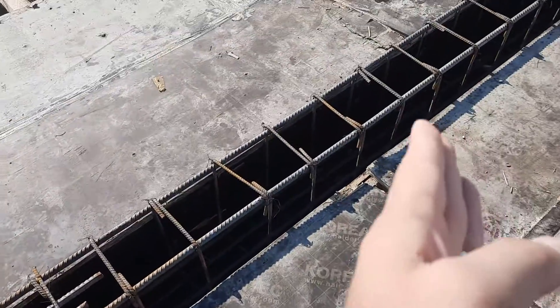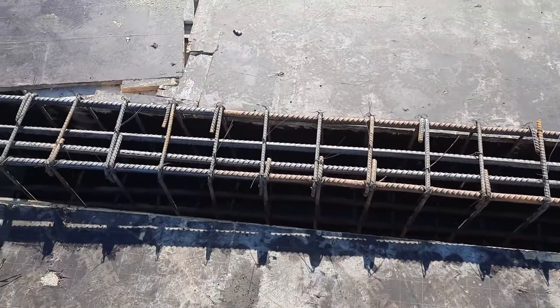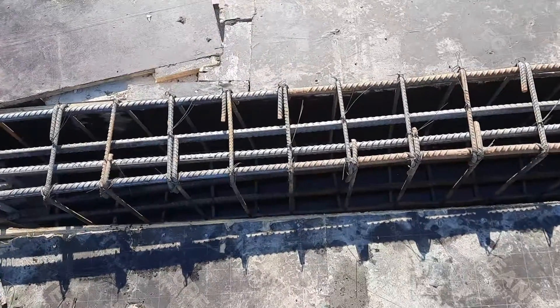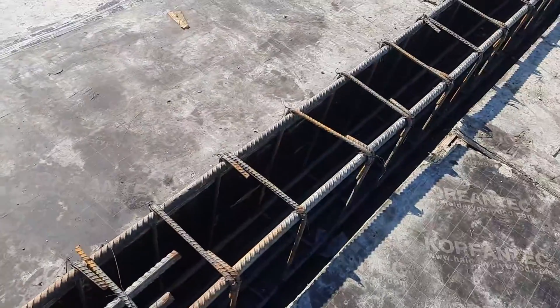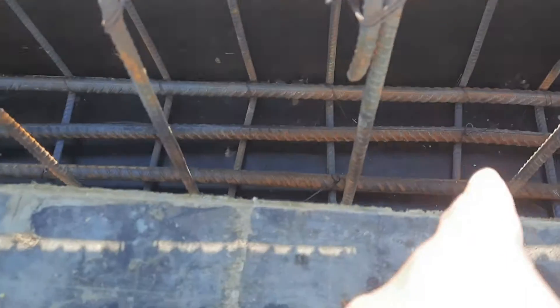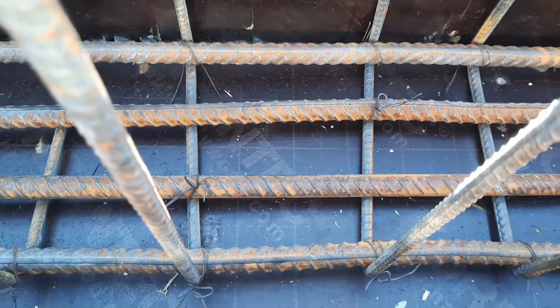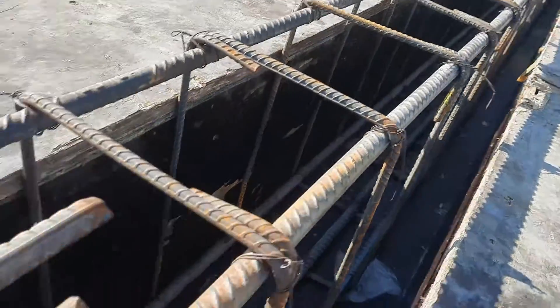You can see this is Section A-A where we have negative bending moment. At the middle of the upper section of this beam we have two extra steel rods, diameter 16 millimeter. At the bottom we have four bars and at the top portion we have two bars — those two bars are provided in the middle to resist negative bending moment.